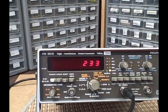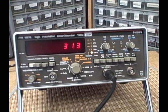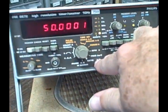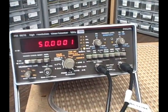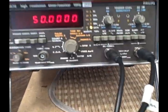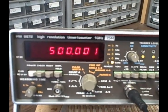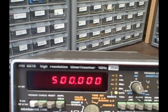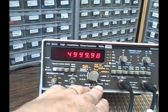The next thing to show is the ratio of A to B, where we use B as a reference standard. Right now we're in ratio A to B and we're getting a ratio of 50. On A we have a 500 kilohertz signal and on B we have a 10 kilohertz signal — 500 over 10 is 50, and we have 50 on display. If I change B to 1 kilohertz it's 500 over 1, or 500. And if I go to 0.1 kilohertz we'd be 5000. So we're developing the ratio of A to B without a problem.